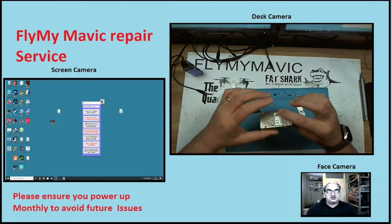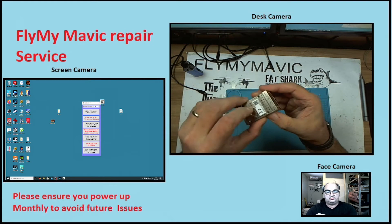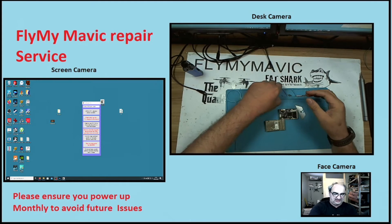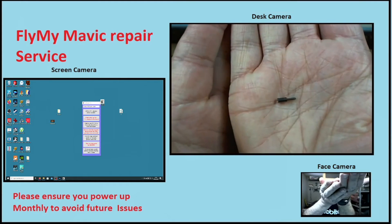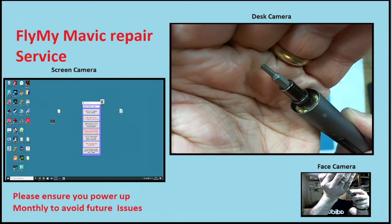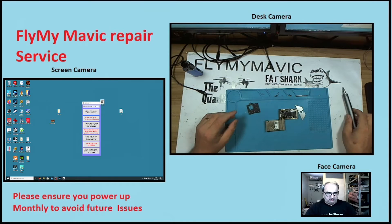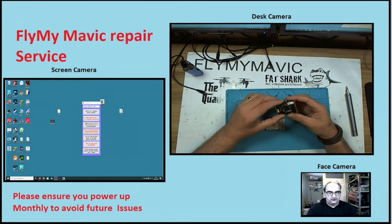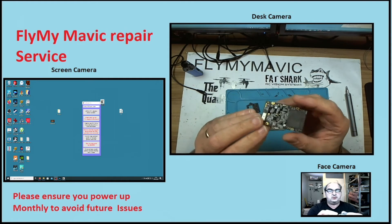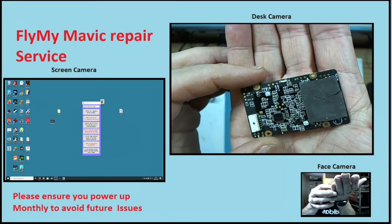To take the module apart, there are four screws on here. When you remove the screws, the board comes out. Then there are four post screws — these little things here. I have a special bit on my screwdriver for those. Take the four screws out, the four post screws out, then take the board out. This is the board we're going to be working on, and as you can see, these are little tiny contact points which you're going to need to solder to — unless you're going to use the new non-solder technique.